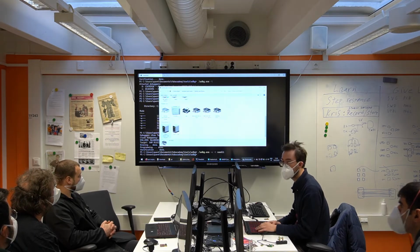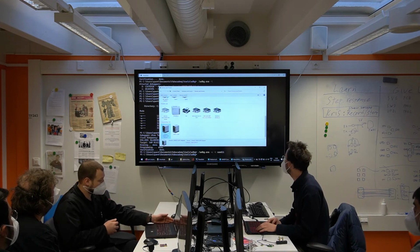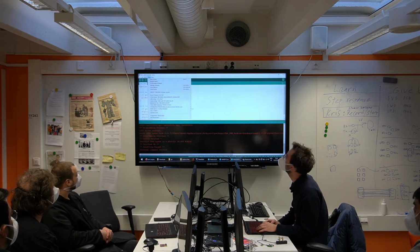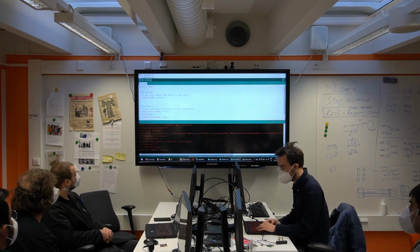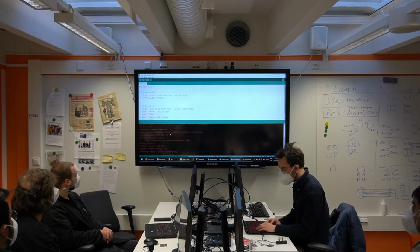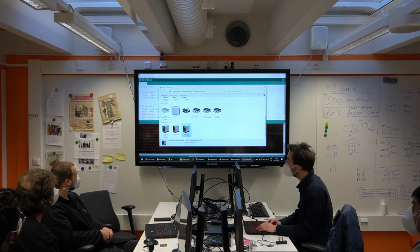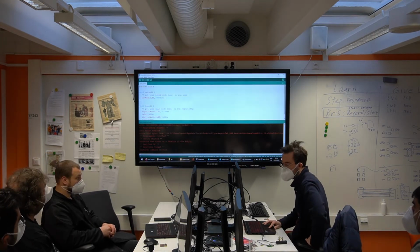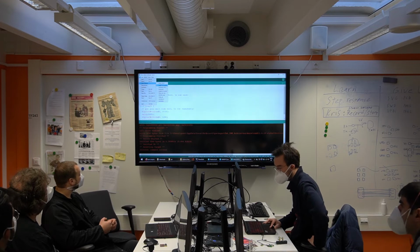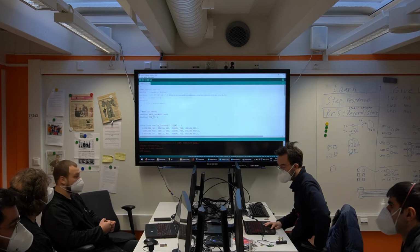So no more compounds. It's just my SWD programmer here. And let's use Arduino this time for flashing the bootloader. The COM port is a weird phantom. It shouldn't be there. Doesn't matter. Look at that. It's there again. And now to use it as a JTAG programmer, you still need to load the code to actually use the serial ports. It's still annoying that it's a two-step process. We can perfectly make it a one-step process.